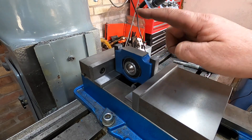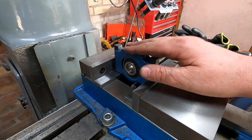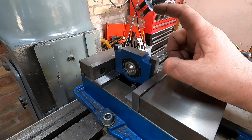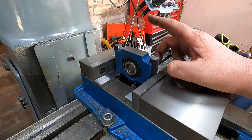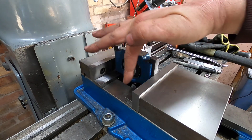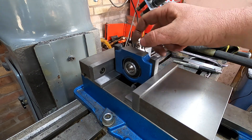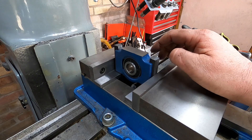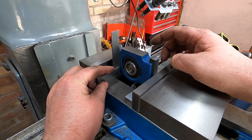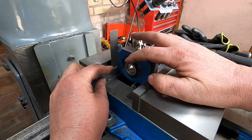I've already faced these off. I didn't want to film that because cast machining is very dusty and I didn't want to get the camera full of casting dust. So I've just set this one back up — I've machined them both to the same height. They're both sat on a pair of parallels front and back with two pieces of 12 mil in the slots, quite a tight fit because we don't want any slop or movement. Then I nipped it up and squared it to one edge, so it's square there and square there — as close as we can get it, and now that's 90 degrees.